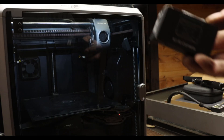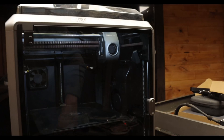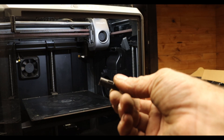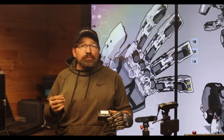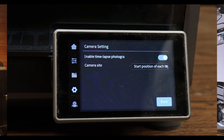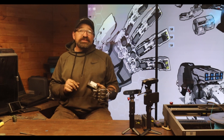The third thing they included in my care package was a camera for my K1 printer. Personally, I think the K1 should come standard with the camera like it does with the K1 Max, but obviously that's not my call. The installation was super easy, completed by simply plugging the camera into the wire harness located above the front right lead screw. I had to remove the little plastic retainer that was double-sided sticky-taped to the side glass in order to get the camera to slide into the proper position — it comes off super easy, just a twist and it popped right off. Once the camera's in place and the screws installed, go to the settings tab and click the slider to enable the camera. The printer's firmware already has the option in place; all it needs is to be activated. Once that's done, your printer will be able to automatically record time lapses of your prints and save them to the USB drive.